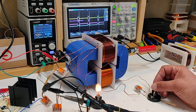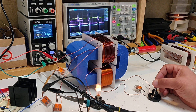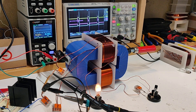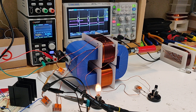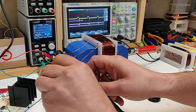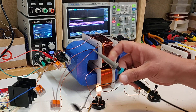When I short, it goes down. And if you can see the bulb — hopefully you can see it on the camera — when I short it, it gets brighter. So we're getting the effect that we want. Let me go ahead and move these to POC1. Remember, floating around 1 watt on the input there.